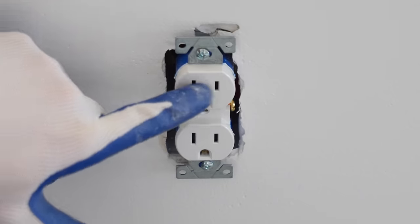Turned out real nice. The primary shop lights are going to be LEDs that are going to be on these receptacles like I mentioned before. And right here is the three-way switch in which powers those receptacles. So what I'm going to do is plug in this light to temporarily check to make sure the three-way switch works correctly. So I'm gonna just plug it in right here. And then we got power, as you can see, up to that receptacle. Let me make sure the switch works.